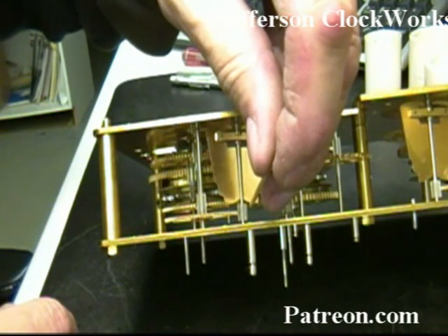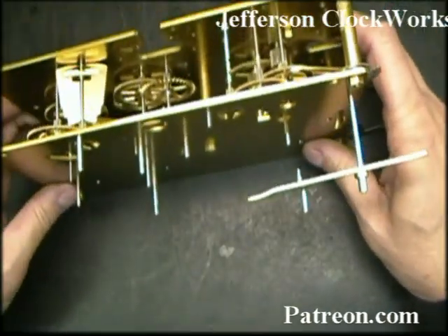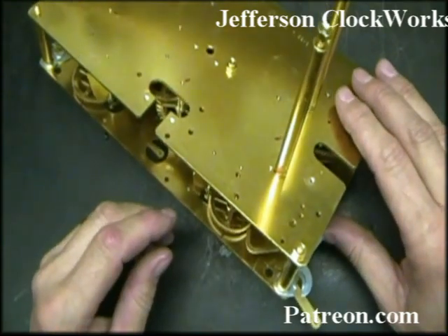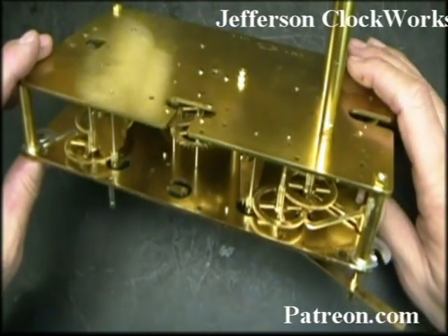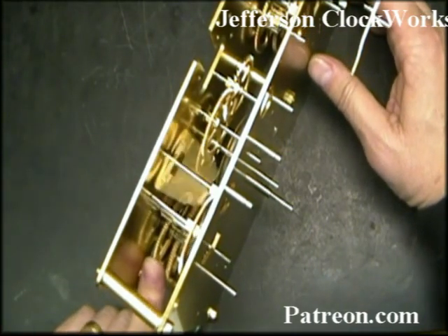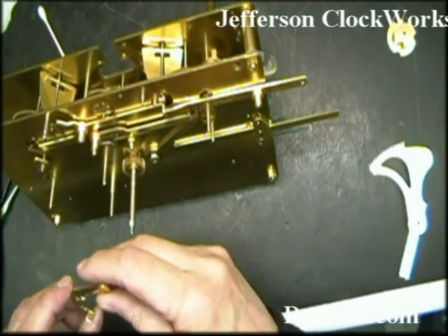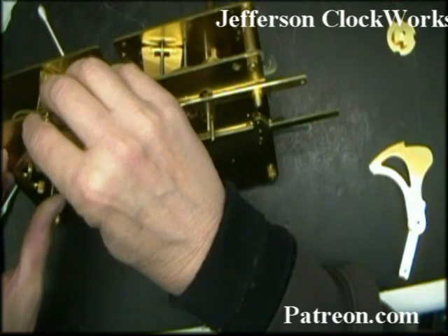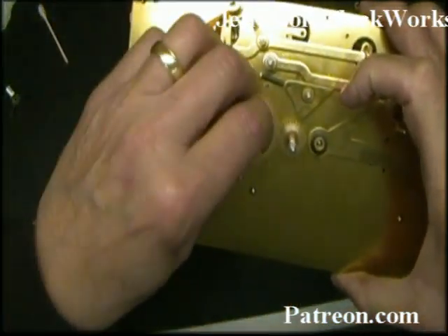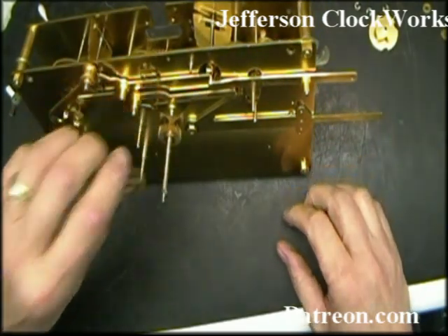You can see it moving up and down — you might even be able to hear it. Check your timing — the timing looks good on the time side. There are only one, two, three, four areas we need to be concerned with timing-wise. Now we'll rotate the train to make sure nothing got jammed or pivots got bent. This part needs to be positioned for the strike — the dividing gear gets placed over here — and on top of the dividing gear goes that washer. We've got a home for all the pieces, no extra pieces. That's a good day.